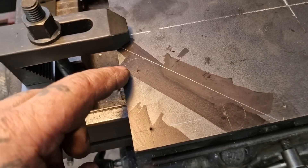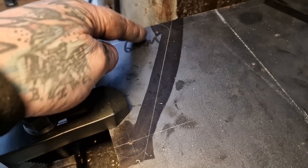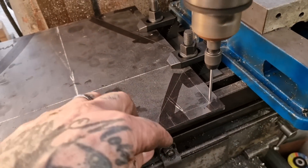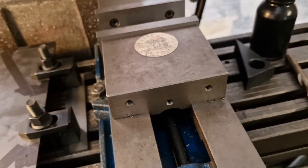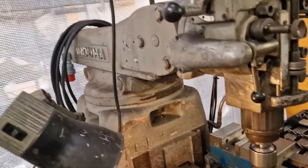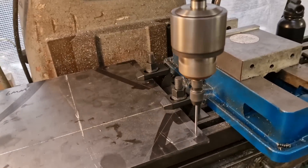Here's where we're at — we've got those marks with the corners and the triangular shape. We'll drill the holes in it first before we cut them out, because it would be a struggle to hold a triangular piece of steel in the machine vise while trying to use the milling machine — it's actually an Induma, which is an Italian make and very, very good too. So what I've done is bolted the whole plate down and I'm going to drill the holes out.